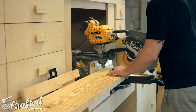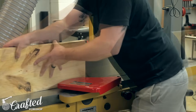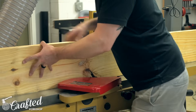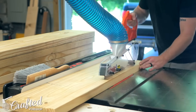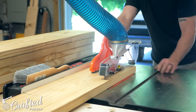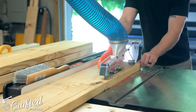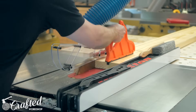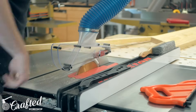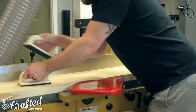I started by breaking down the parts to rough size, leaving everything long so it could be trimmed to final size later. I used 2x10s for the top even though the final width of my top boards was 7 and 3/4 of an inch. This extra width allowed me to remove the rounded edges from the pieces as well as cut away any damage to the edges of the board. To remove the rounded edges I used my jointer to square up one side, then ripped off the other edge at the table saw. These steps are definitely optional but they really make the top look a lot cleaner if you have access to these kind of tools.